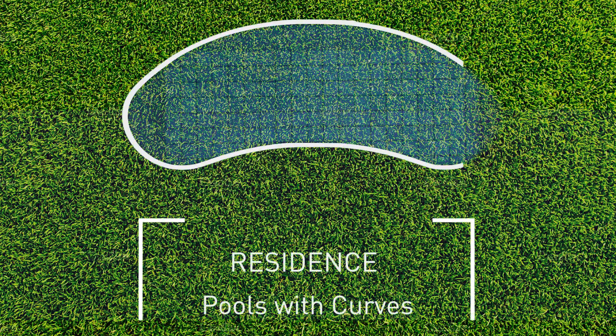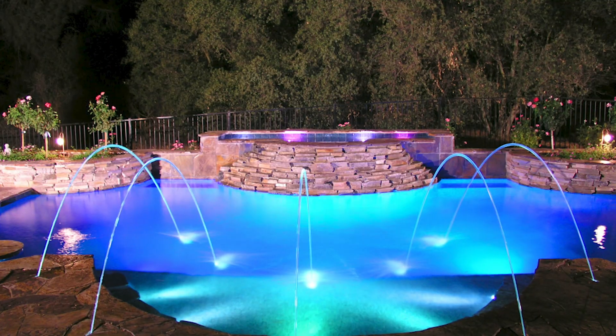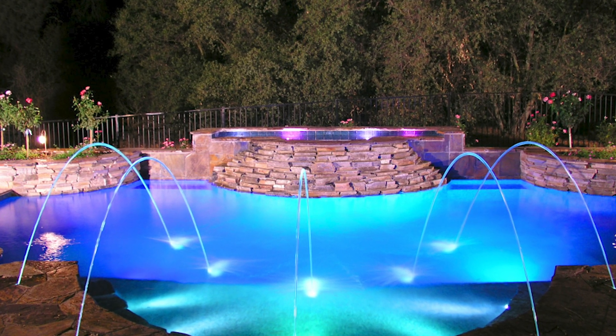But if you're dealing with a freeform pool, the 8-foot rule doesn't always apply. What you should be doing is assuming a 60-degree beam spread. If you plan on 60 degrees, you will evenly cover the back of the wall on a freeform pool and have even distribution of light.